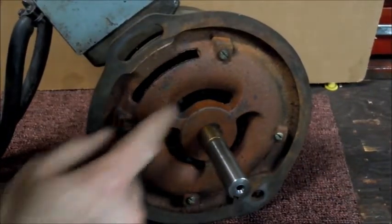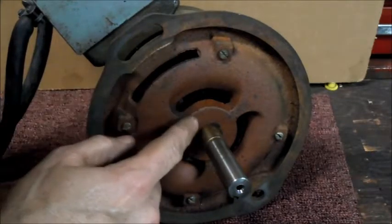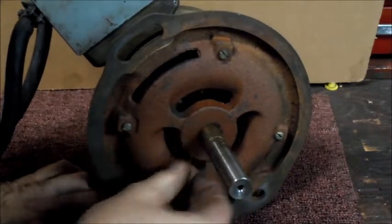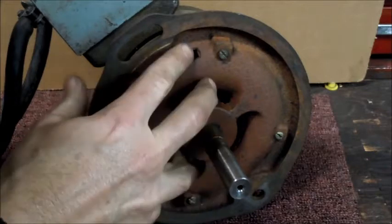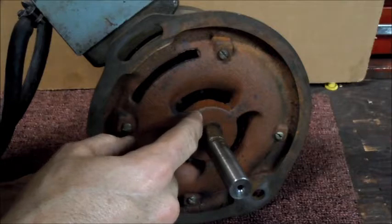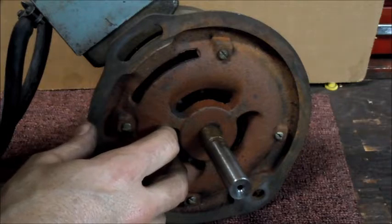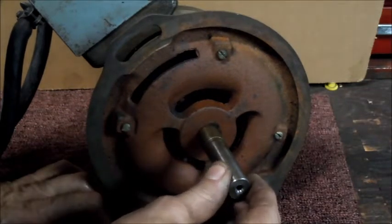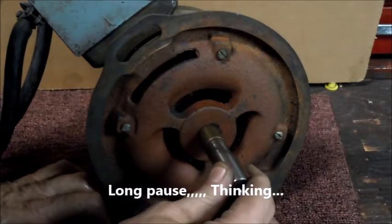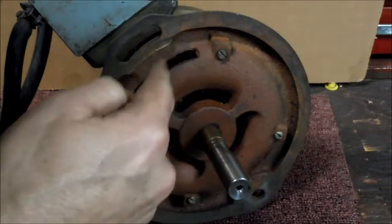And then what I think happens is, if I take these 4 screws out, this flange here, which has a bearing pocket at this end of the shaft, which I should get cleaned up first, I'm assuming this will come off and either leave the bearing on the shaft, or the bearing will come with it. And then that allows, I think I gotta go that way to push the bearing out of the top side.